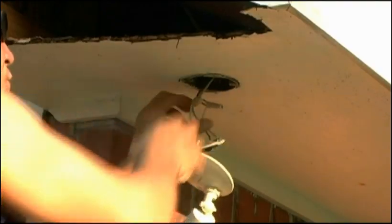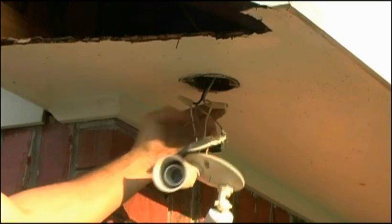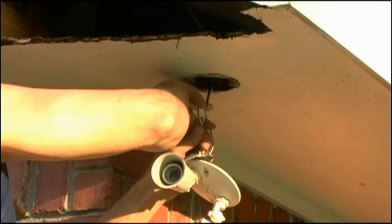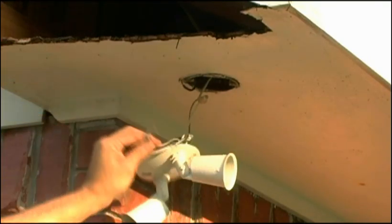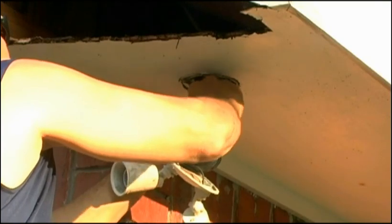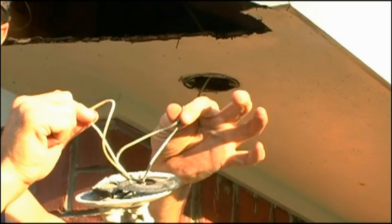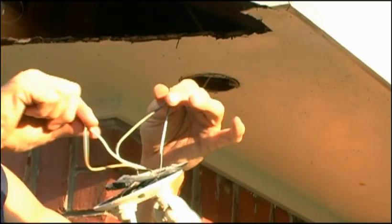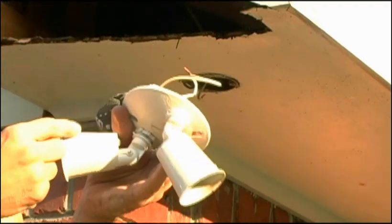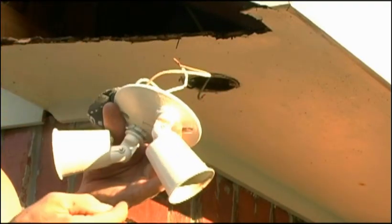You see these two wires — this black one is your hot and this white one is your neutral. It's disconnected already; the power's off, so I'm just going to take them loose. On your wiring, your two hot leads go to the one side and your two neutrals go to the other side, and you can see there's one lead and one neutral for each one of the lights.